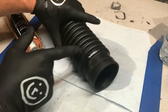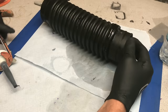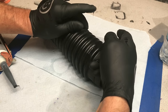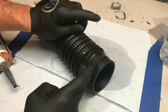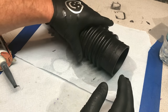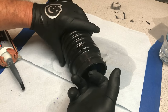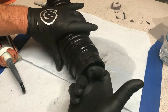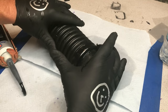Now, if your crack is inside your rib, all you do is fill it up. Take this and go over it like that, and that thing will be sealed up and stronger than the rubber itself. You can put a bead along the side here if you want — it'll never split apart again. On the inside, put it on your finger and go inside to fill up the rib on the inside, press it right up in there. We'll let that dry about 24 hours, put it back into use, and it will last and last.